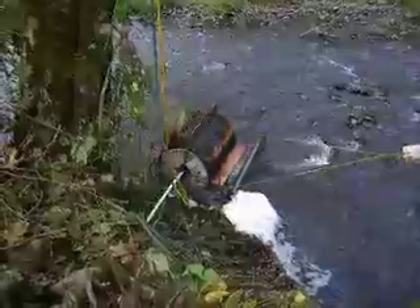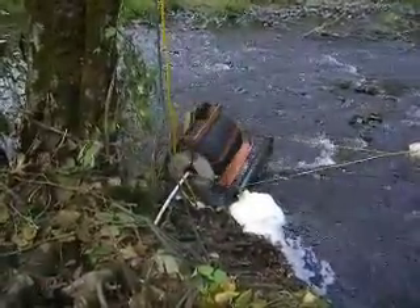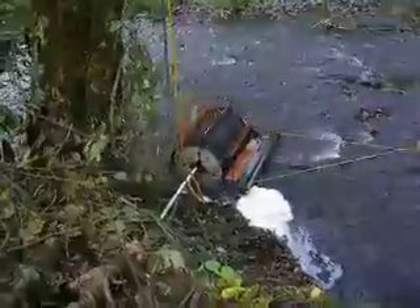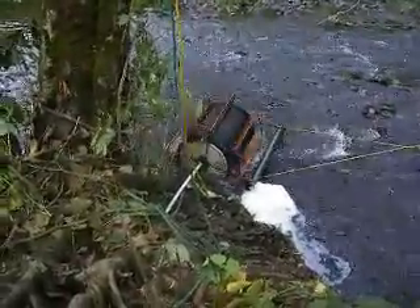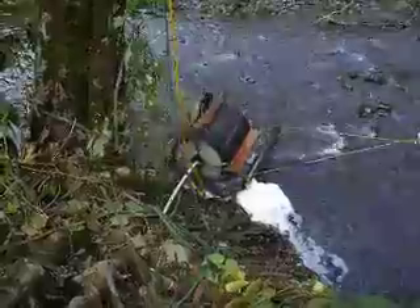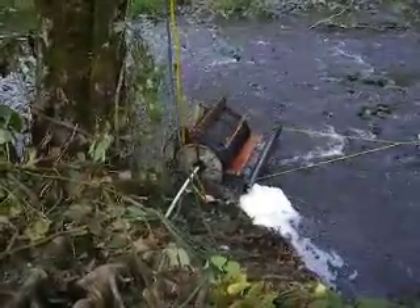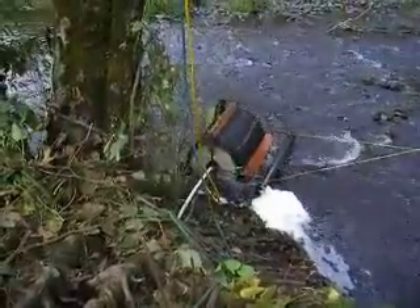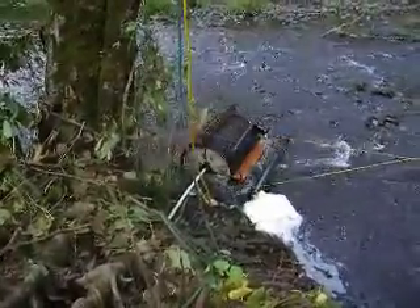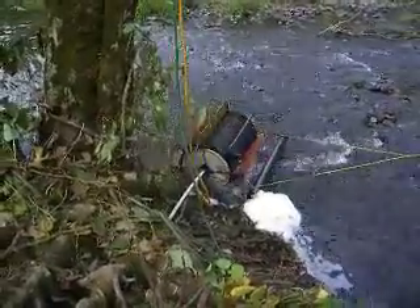Effectively, at this rate, it is able to lift water somewhere around forty-five feet efficiently at about three gallons a minute, which is pretty good considering the energy being utilized is equivalent to a person riding a bicycle at ten miles an hour on flat ground.